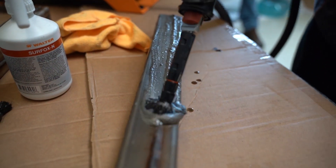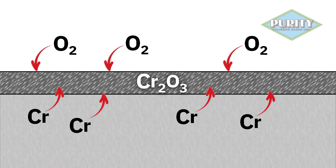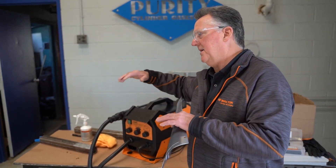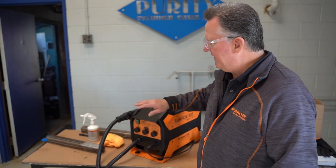The beauty of this is it's efficient, safe, and cost effective. On stainless, there's a chromium layer which is what protects the product from rust. I always compare it to getting a cut on your arm — if you put antibiotic ointment on there, it seals the cut and brings that skin layer back. That's what this does. When they weld and you get weld burn and contaminants on the surface, it affects that chromium layer which makes it rust. So you want to clean that up after welding.